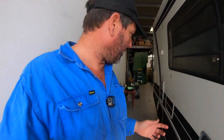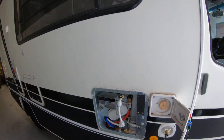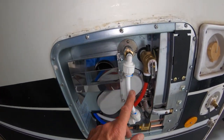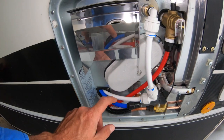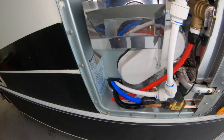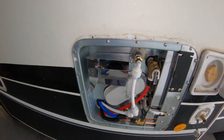I've hooked up the water, I've tested the gas - so that's all good. Got all the pipes going through - the 70-degree water is on that John Guest white pipe. The gas and everything all go through this little hole, so we've got to seal that up once it's all done. Here's a pressure relief valve going down there to leak out. The problem is that when we're running the pump, it just takes a long time to turn off - it should take about three seconds.